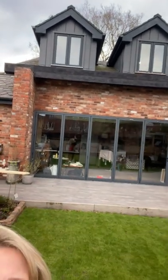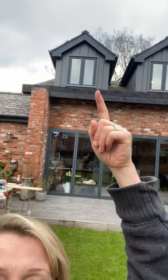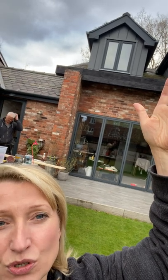There's a reason for that which I'm going to talk you through. There's another area that's been problematic - can you see the dormers on top of the extension? The bifolds are aluminium and the window frames are pine - softwood pine. Because they're quite small we could use softwood, not hardwood. But to be careful, because the sill is the bit that gets the most weathering, we put a hardwood sill. We used exactly the same water-based primer, undercoat and top coat on both the softwood frame and the sill. And guess where the paint popped off? On the hardwood.